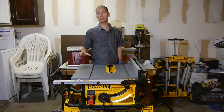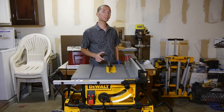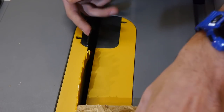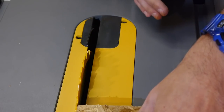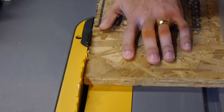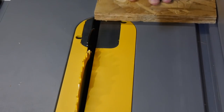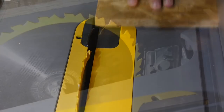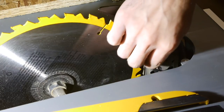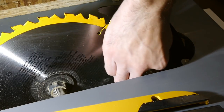After using this saw in several cuts, I noticed that it did need a few adjustments to make the saw perform better. I noticed that the riving knife needed to be adjusted because it was slightly beyond the right side of the blade, and as you would push the workpiece through the cut, the riving knife would stick out and be pushed to the left side, while also misaligning the blade slightly as it moved over. This was an easy fix, as all I had to do was adjust a few screws so the riving knife would no longer touch the workpiece.